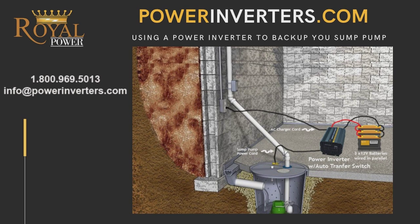If you have any questions about setup, how it's actually going to run, or running tests, feel free to contact us. You can also check out our guide that'll show you the amount of power applied to the inverter versus the amount of time it'll run off each battery based on the size of that battery — because every 12 volt battery is a little bit different in size, usually based on amp hours. You can look at the power rating of the battery to know how large a battery you have. Give us a call to discuss which type of batteries you might need depending on the size of your pump, and we can also discuss how often you have outages to get you the proper setup. Once the setup is done properly, it's pretty much left in place and you're all set to go.